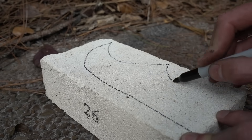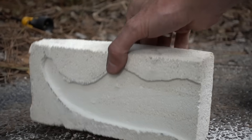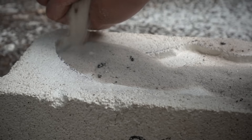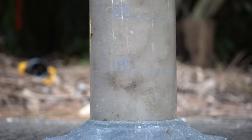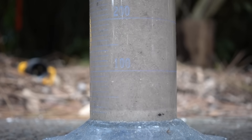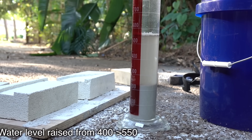I'm sad to see James go, but it's time to start making the sword. I'm going to be using insulating fire brick to make the mold. I started by drawing out the rough shape of the sword and then using a router to remove material from the brick. I filled the mold with sand and poured it into water to get a rough idea of how much metal I would need. The sand displaced about 150 cubic centimeters of water, so rounding up to 200, and with steel's density of about 8 grams per cubic centimeter, that means I need about 1,600 grams — about three and a half pounds of metal.